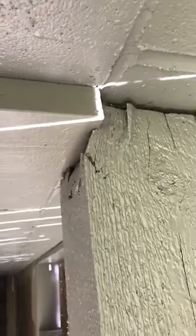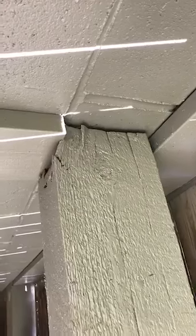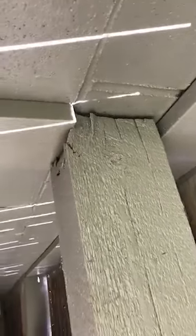I can push up and down on this — it's rotten up inside here from being wet and wicking water into the end of that. So as it rots, it gets weaker. And because it's only sitting on a one-and-a-half inch ledge, that's nowhere near enough support. So this whole beam needs to be replaced.